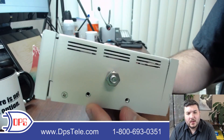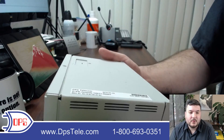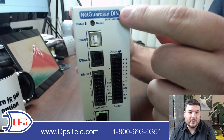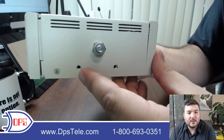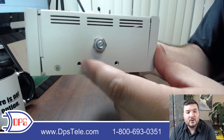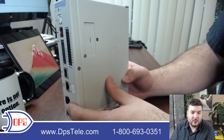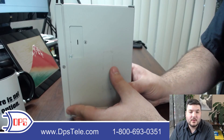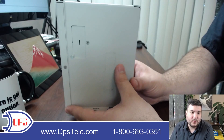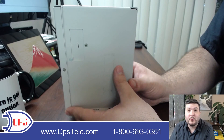One last thing about mounting. You can do a DIN rail mount, which is the most common use — obviously it's called the NetGuardian DIN so that's the intent. But we also offer flexibility with these holes here: you attach a 90 degree angle bracket on both sides and it can sit flat against a wall, giving you access to the ports from the side. So if you have wall space but no rail, you can just mount it that way. The footprint is a little bigger but it's certainly a quick way to mount it.